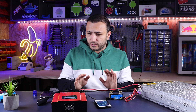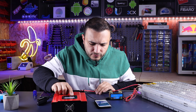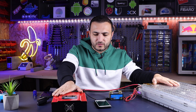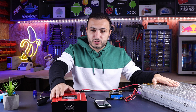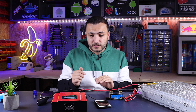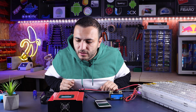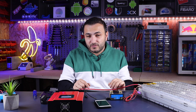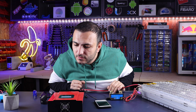Based on this device, for me it's okay. Reading: 443 watts, 443 watts confirmed. In this moment this unit can deliver 40 amps, so what you read on the box is correct. My battery is connected at 24 volts and this device was set up to charge this lithium Tesla battery. On the label it says maximum 1040 watts; in this moment it's delivering 1024 watts, charging my battery at 39.2 amps, 39.3 amps.